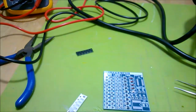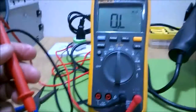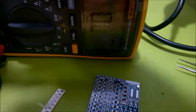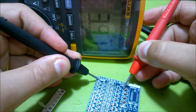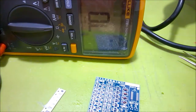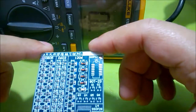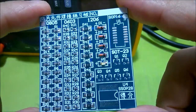It works straight away. Let me bring my multimeter here. If I measure the resistance across the diodes from one end to the other — there we go, 1.3 kΩ, same as the other board. I didn't have to rework anything; it was just working right out of the box.